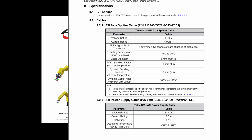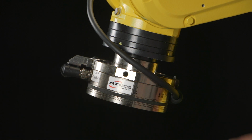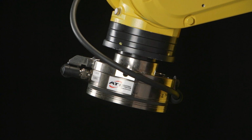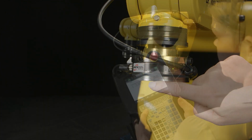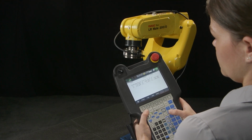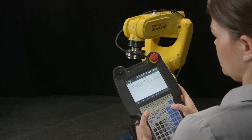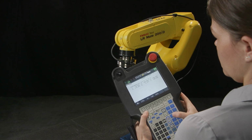specifications. Verify that the sensor connection is tight. Ensure that there is no tension on the sensor connector. Leave enough service loop for robot motion. Confirm that the sensor axes align with the robot default axes. If they do not, check the interface plate installation. FANUC-Ready sensor kits are intended to align. If misalignment is expected in your application, make note of the degree of rotation.